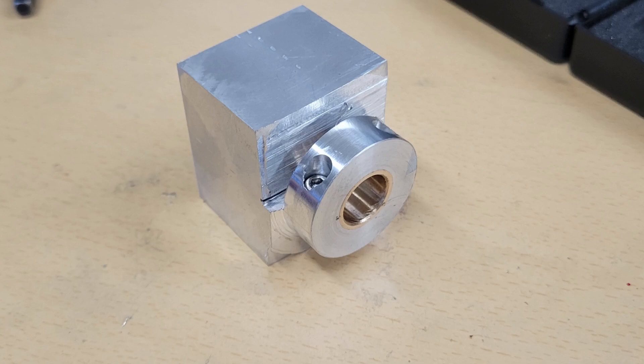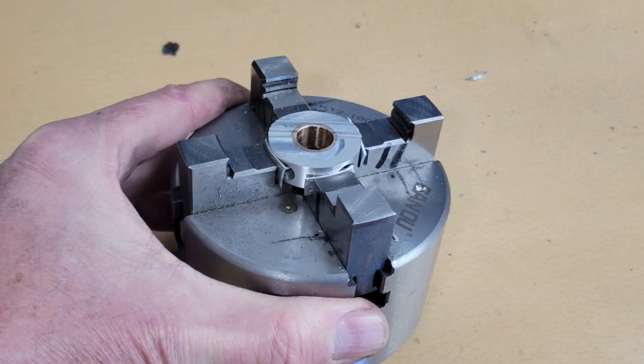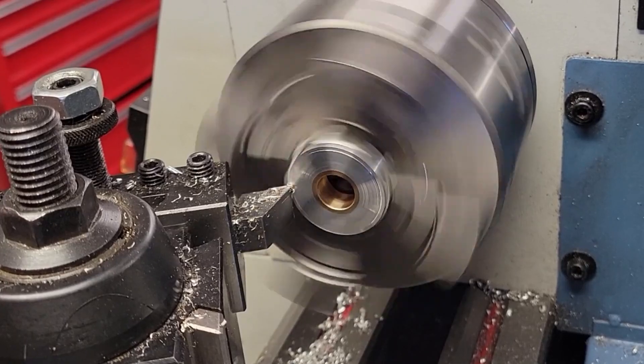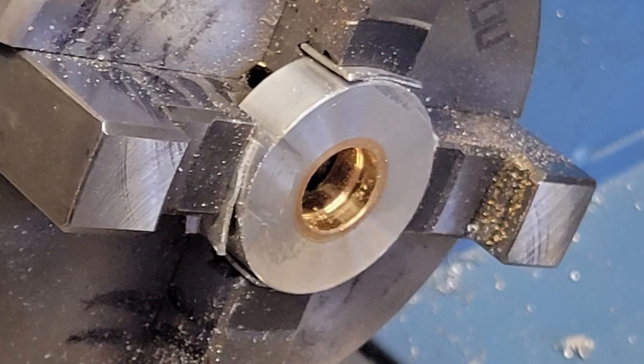The hard work is now done. We take the workpiece out of the lathe and separate the bearing from the base stock with the bandsaw. We remount it in a four-jaw chuck using soft aluminum packing to protect the outer surface, then face the backside to bring the bearing to proper thickness. Finally, I use the small boring bar to machine a groove in the center of the bushing — it's only about 10 to 15 thousandths deep and it helps the flow of oil from the crankcase through the bushing and out over the bushing crankcase surface.